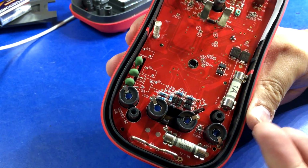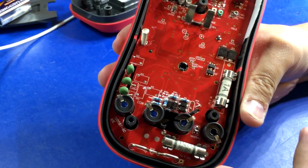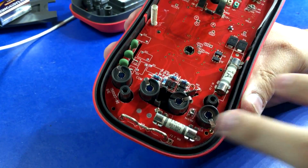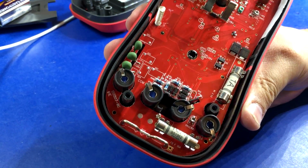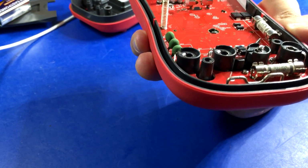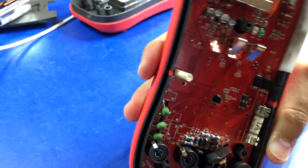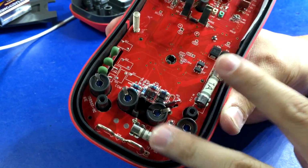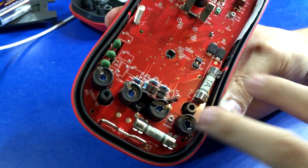3 PTCs, it's better than it could be. And they're dinky size fuses, but at least they're the ceramic ones. Hopefully, actually they're probably not the right voltage rating, but at least they're high rupture and they're the ceramic, not the glass ones that'll just blow to a million pieces.